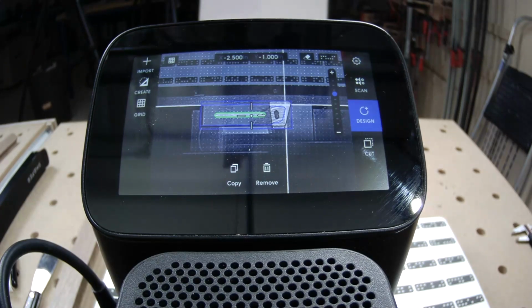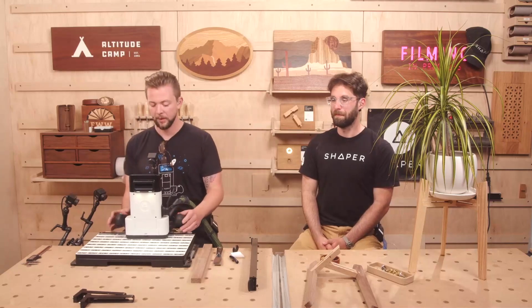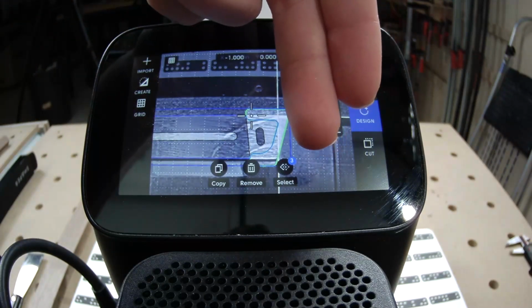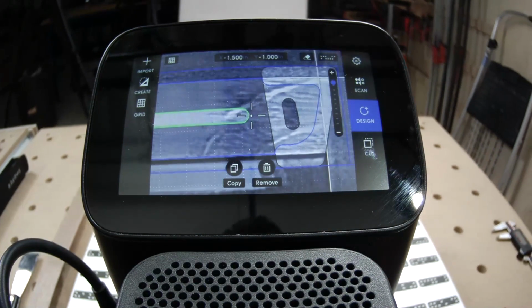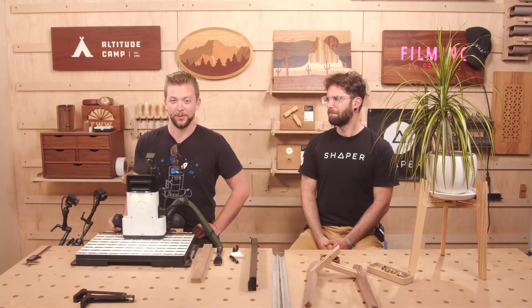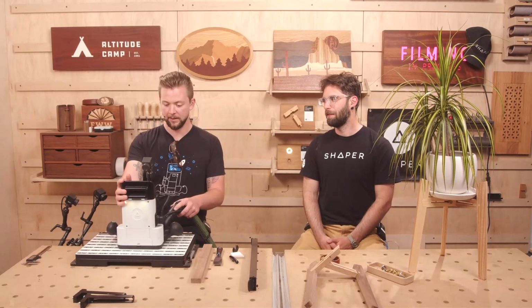Being able to name a workspace like this is great, and we're fortunate here to have multiple shelves, so I'm actually working on 2 different shelves. But if I'm making a couple of these, I can jump back and forth, and I still have my workspace called the tangent stretcher. I have created a grid off of the top and right side, and I place my file right there. We're going to do this in a couple shots. This is a through cut for the thumb screw, and this is a hybrid lap joint mortise and tenon, which is super cool. A mouthful, but very cool and beautiful. Especially beautiful because we're doing mixed wood species on this one, white oak and walnut. So that joinery really pops.